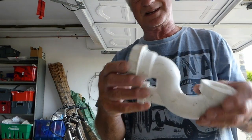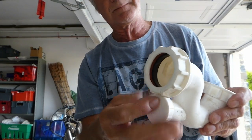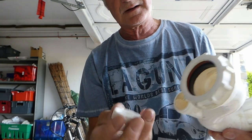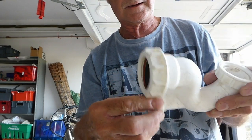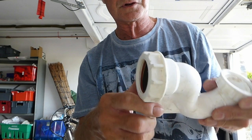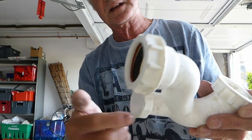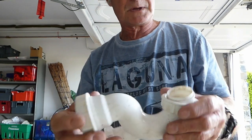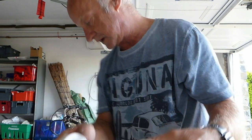This one here is a bath waste — another one you're always getting leaks from. Sometimes you get a little cap end on the end here; they're a nuisance, but there's a little washer in there that can also leak. They're quite often on older systems and are used as an aid for clearing the bath waste out. Again, the same configuration for the pipe on that end — and as you can see, no washer on there, so don't use it with no washer on it.